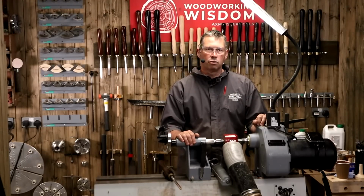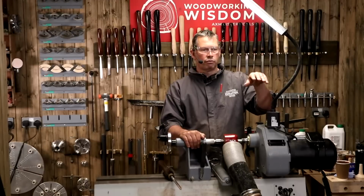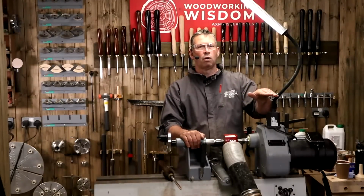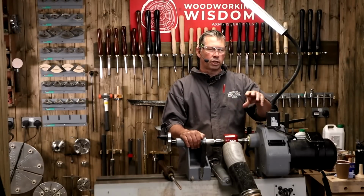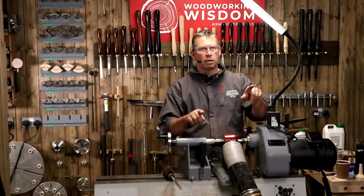I guess that's not a casting resin, Martin, because the idea with resin, you want to keep the temperature down, not up. We want the length of time that it dries to be long, because otherwise you're going to have bubbles. The bubbles are going to fix in position, and you'll get too much chemical reaction. You need to keep it cool. Remember, with a fast cure time, you're going to get heat. So you do need to be careful with that.